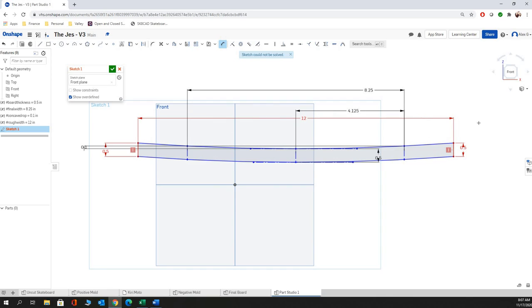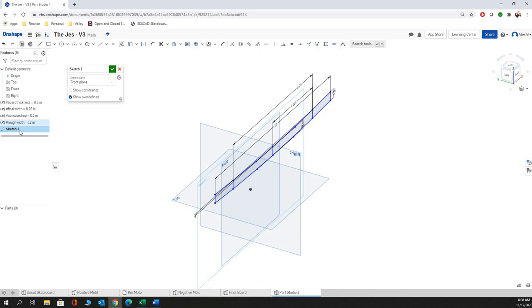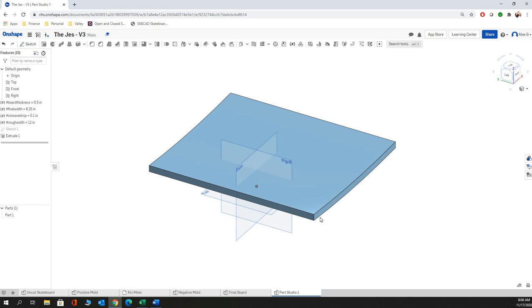I have some red lines in here — got something over-dimensioned. Okay, that should be good now. So now we're actually ready to extrude this. We're going to extrude it for right now to a distance of 14 inches — but in the next video we're going to put in a variable for our wheelbase, and that's going to determine the length of the center of our board. So we're going to say 14 inches, symmetric from the center of the board. Now you've got the center part of your board, and then we're going to go in and do some offset planes later on.